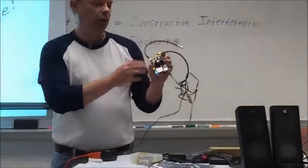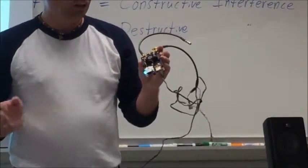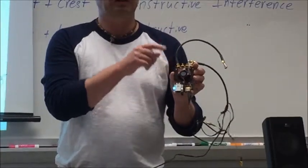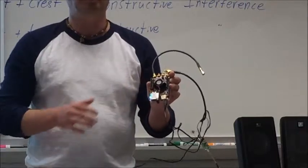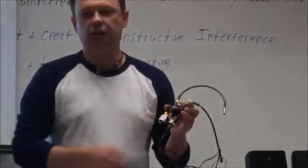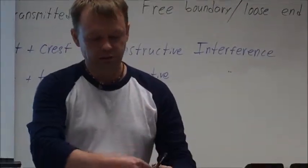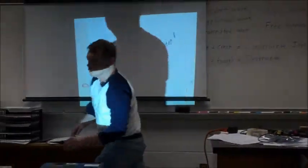There are two processors in this FPGA. There are two digital to analog converters which provide signals, two analog to digital converters which measure the input, actually sample the input, and you can connect it to the network. Here I have a wireless interface. So first let me connect to the network.